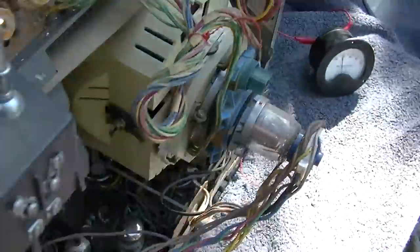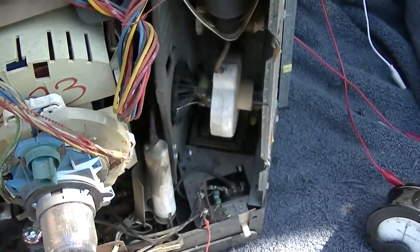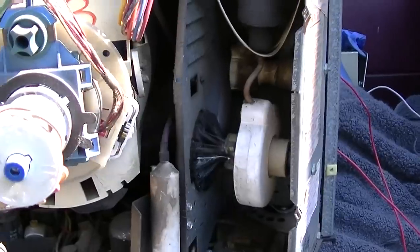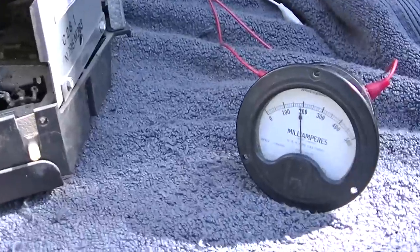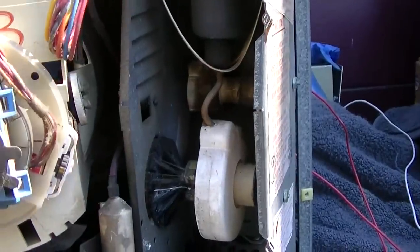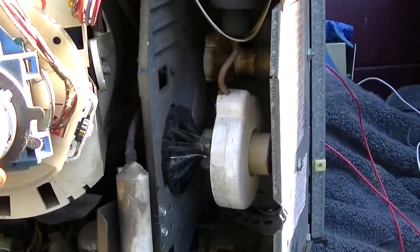I must have grabbed the wrong set. I'm gonna let it run for a few minutes. But I definitely remember a bunch of black tar leaking out. All right, I must have grabbed the wrong set here, because this thing's just cruising along right at 200 milliamps and nothing. So it must be the set with the good CRT in it that smoked the flyback.